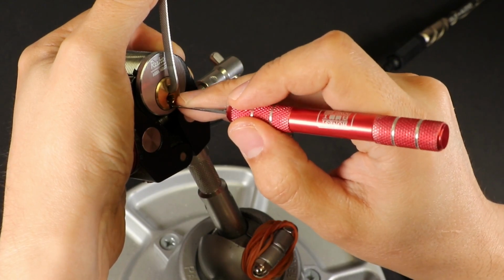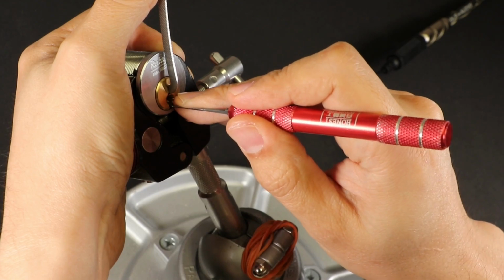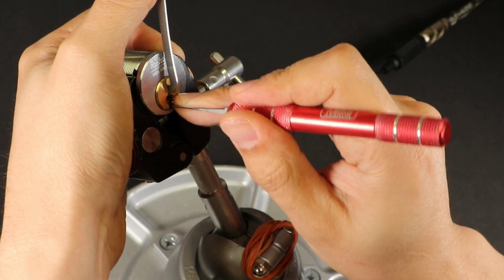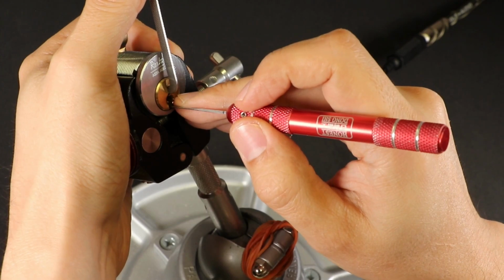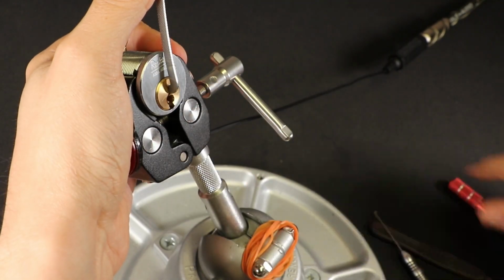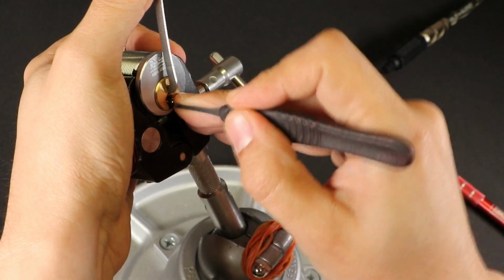And okay, so this one doesn't seem to be springy up top. So I have a feeling that either it needs to go a little more. Doesn't seem, well, maybe it is. All right, so I put it up a little more, but it doesn't have that springiness before the hard stop. So I have a feeling this front one probably has the wrong rotation, or it is lifted too high. So I let off tension to drop it, and in the process, I believe I dropped some of these top barrels. So we'll go ahead back at these.